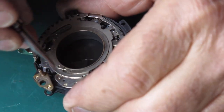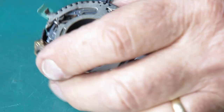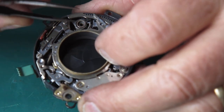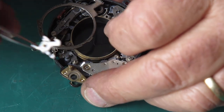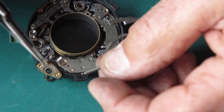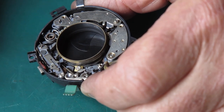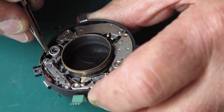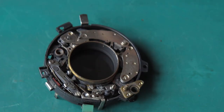We'll take this all apart. I'll unclip the front retaining ring — that's just a spring clip that holds it in place. Here's the shutter speed settings cam plate. Take out this pinion, take out this curved rack, take out this latch — that latch holds the shutter in the cocked position; without it nothing works. I'm looking at this because the last loop of that spring is quite open; I'm a bit sensitive to that because I've just worked on a camera where that spring was broken. I'll unhook the main spring and look at the state of it — that's got quite a bit of tension. That's a good spring, and everything else can start to come apart.